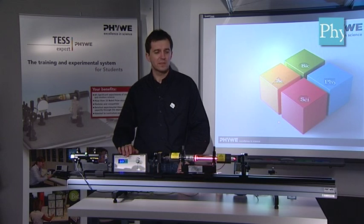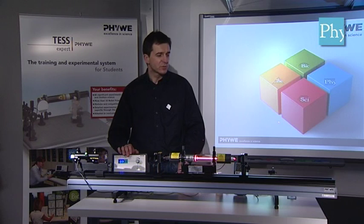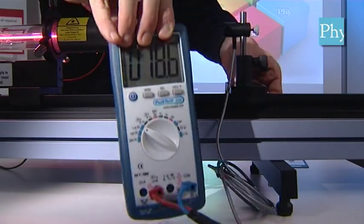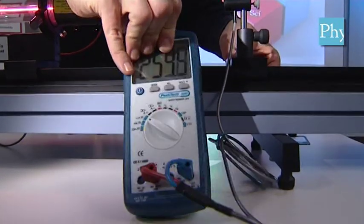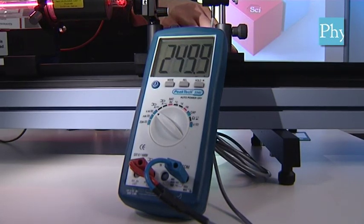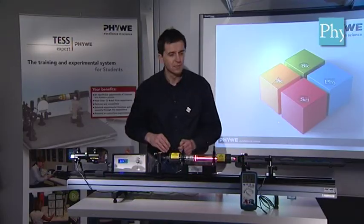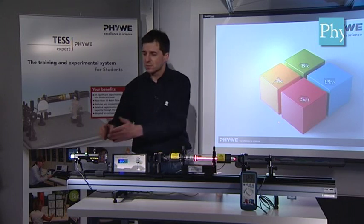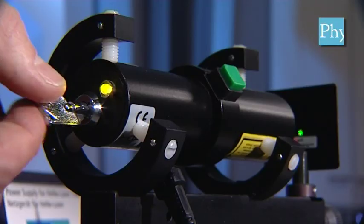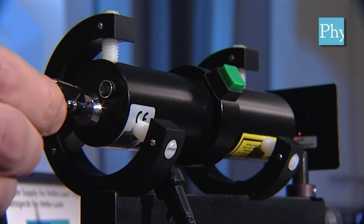To make an even more precise adjustment of the laser, it is better to use not only the naked eye but to place a silicon detector in the external beam and take the reading for the current that it measures as a value to optimize it further. This green alignment laser interferes with this measurement now, so I switch it off because it has done its job.